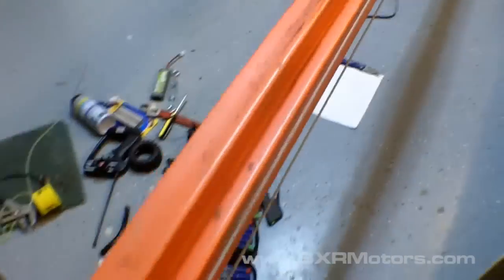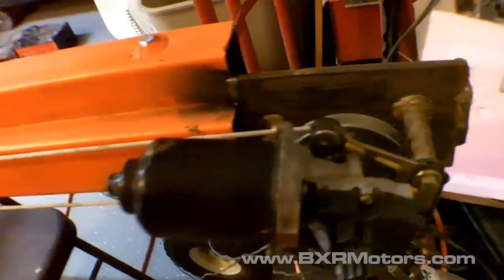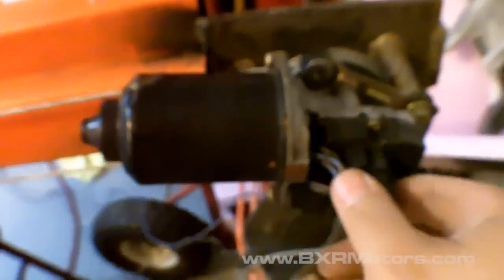Down at the messy end, here is the windshield wiper motor and how it's affixed. All the cabling runs through the system to the motor. Interestingly, this motor actually works off my little RC battery — I was surprised, but it'll pull the whole thing. It's a little slower because it doesn't have as many amps. I'm running 10 amps at 12 volts through this motor right now, which is a ton. It's just a junkyard specialty.